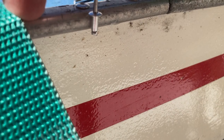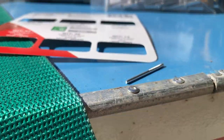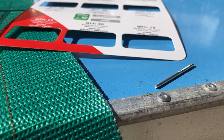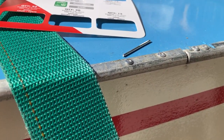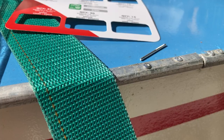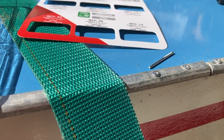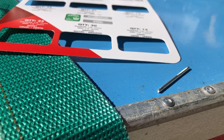The rivet is going down and gripping almost all the way to the bottom of the seam, so it's going to work well. But not every boat is the same — sometimes the trim is a little deeper or the seam is a little thicker, and that adds up to where you might end up needing a 1/4 inch grip depth instead.